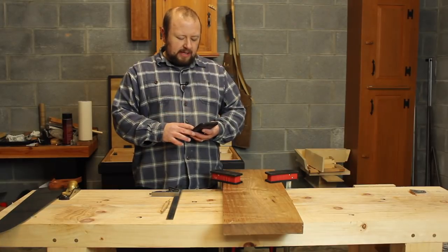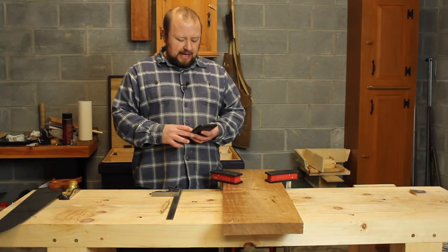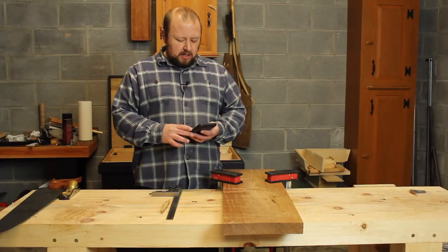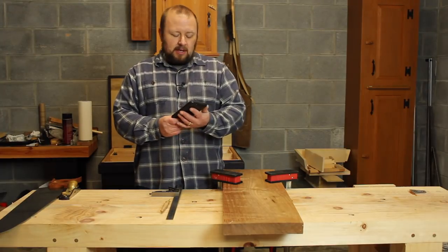Our next question comes from Jay. He's building a countertop out of 1½-inch thick walnut, final dimension 26 by 52 inches, consisting of 6-inch wide boards glued together. He's interested in how to create a flat, square, and smooth surface on the end grain. On his split-top Roubo workbench, he cut the ends with a crosscut saw then used a sharp No. 5 to smooth the end grain, checking for square and flat often, sharpening the blade several times — but the result wasn't as flat and smooth as hoped. He asks about the process for planing thick end grain hardwood flat and square.